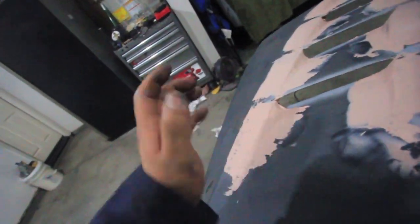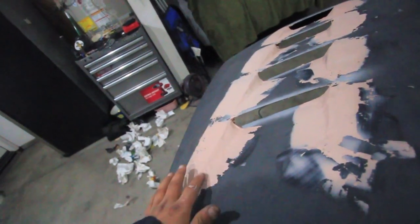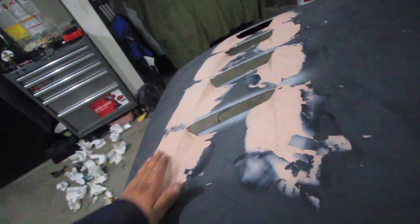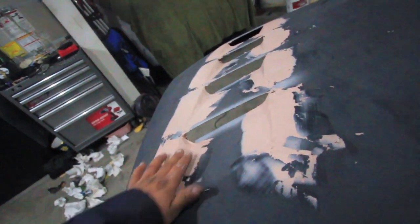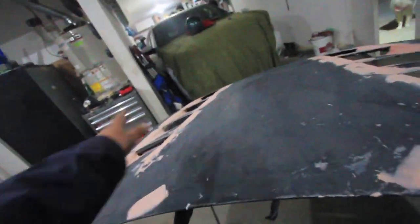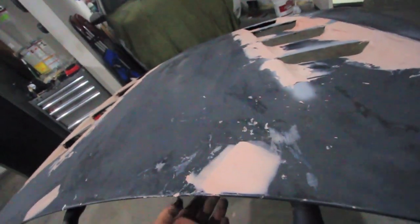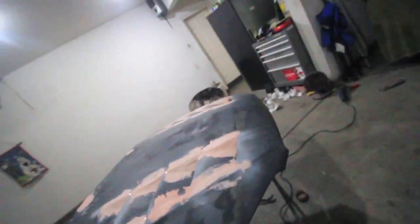Once it's pink, lay it over the surface. Then you just go over and start sanding it whenever it's dried up and you get the shape you want. This is basically what it ends up looking like after all the bondo — it seems like a lot but I have to use a good amount to get the slanted shape and go over all the little bumps so none are showing. I also deleted the windshield wiper squirter by cutting under it, putting tape under, and bonding over it — now that's covered up on both sides.